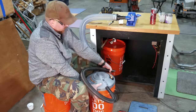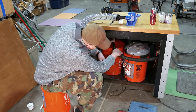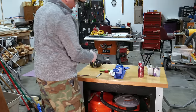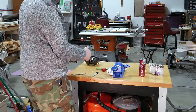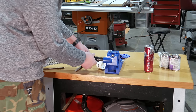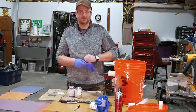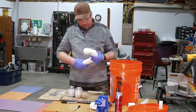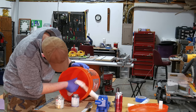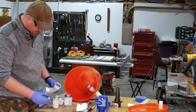I'll put a shopping list in the description below this video for this exact setup. Before we get to the gluing and sealing stage, let's perform one last test. Yep, we still have suction at the end of the hose. All that's left now is just to button things up. If you haven't had the pleasure of fitting PVC plumbing pipes together before, don't worry, it's pretty simple. You will need to pick up a can of PVC primer and PVC cement. The first step is to make sure that the pieces fit together nicely, because PVC cement sets up really fast and once it does set, that's pretty much the end of that. This is why we dry fit all the pieces along the way.